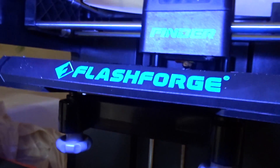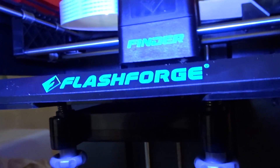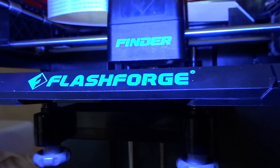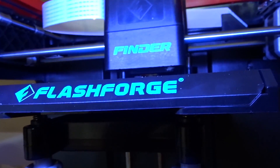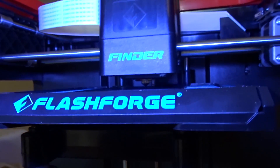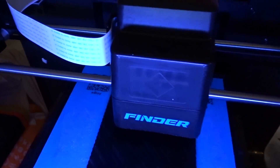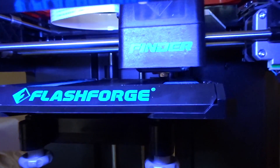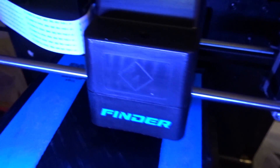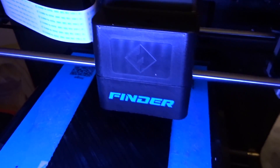So I've been playing around with this all day, trying to make parts and screwing up parts. I got the warpage figured out — my PLA temperature was too high, so I lowered the temperature and so far it seems to be printing pretty good. I also had to put the program into expert mode and add a raft to the print. Right now I'm printing out a little gold sluice mat that I might add to my cleanup sluice — I'm going to see how it turns out.